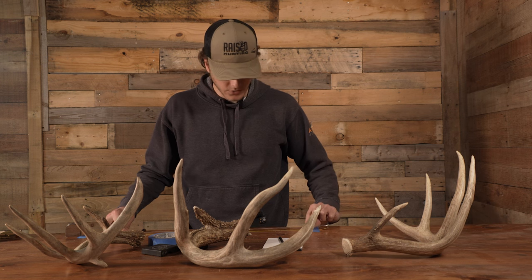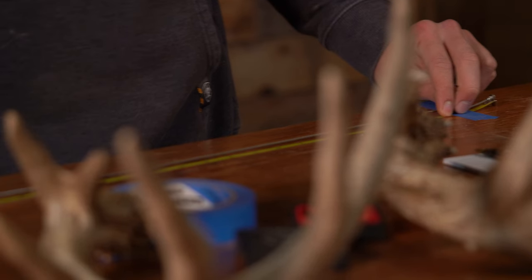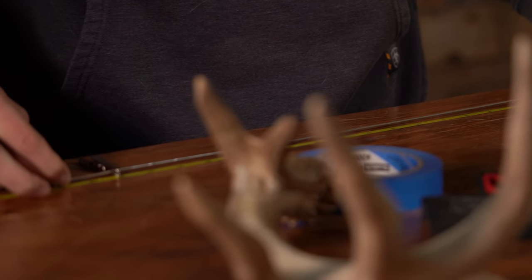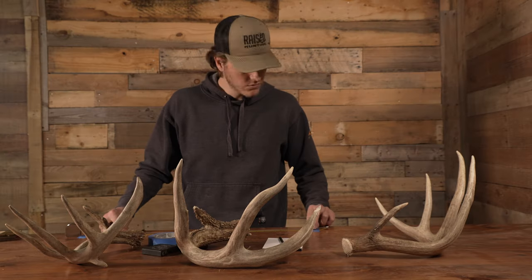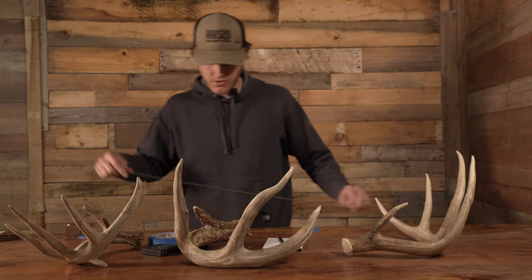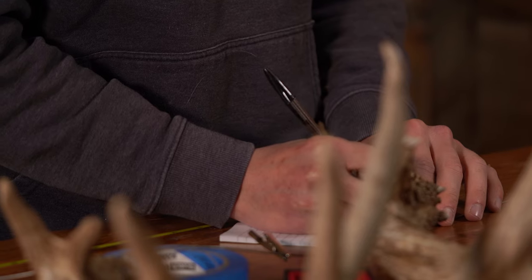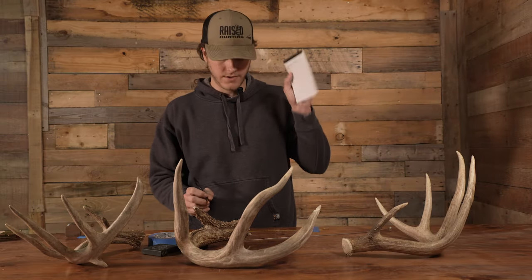So just to explain that really quickly, 22 7/8 is where this would fall if I rounded to the nearest eighth. But instead I got the 16th, I got the larger 16th. So that's going to give me the next eighth. So we're right at 23. So all I'm going to do now, take my notebook I showed you guys earlier. I'm at 23 0/8. So I wrote that down, right?